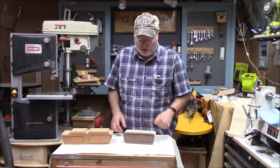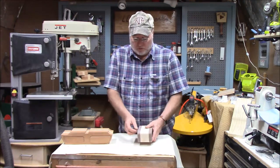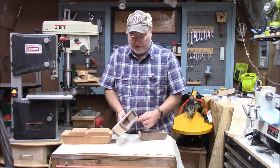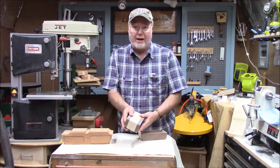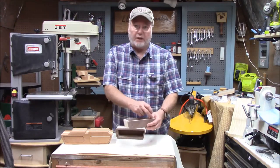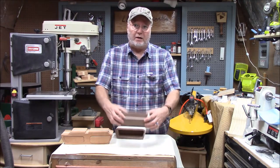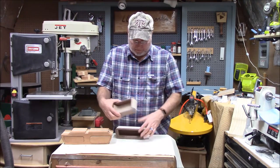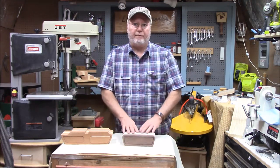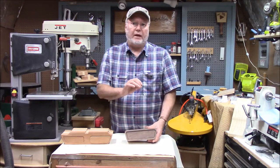Let's see what we've done so far. We had our block. We cut the outside to shape. We cut the back off. Then we cut our drawer cavity out. Then we glued the back back on — that gave us this piece. We cut the back off of it. We cut the front off of it. Then we scooped it out, and then we glued the front and the back back on — that gave us our drawer. So essentially this bandsaw box is complete, except for some sanding, smoothing, and finishing. And that's the process.